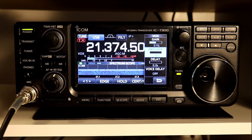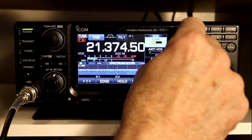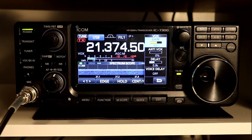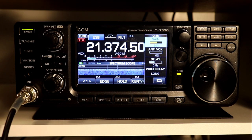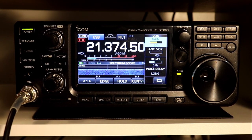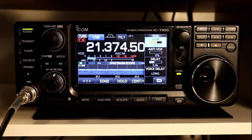Let me demonstrate this — I'll let you hear what would be coming out of the rig transmitter through the monitor. We'll put it into VOX. Testing, testing, one, two, three. Let me set the delay up just a little bit and turn the gain up slightly. You should have heard there that the beginning of my voice was cut off. Now let's set the delay to long so you can really see how this works — I'll let you hear it with both microphones so you can hear the delay. Hello, testing, one, two. Now let's listen to it just through the radio audio and you'll see how that eliminates the cutoff in my voice.